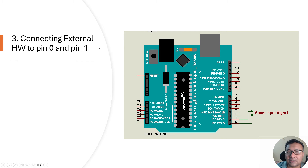The third issue is a design mistake: accidentally connecting signals to pin 0 or pin 1. If you connect anything to those pins, you will not be able to download programs, because pin 0 and pin 1 are the RX and TX pins used to accept data from the PC. If you need to use all 20 pins, try to make those connections removable with a jumper, or simply remove the pin 0 and 1 interfaces before downloading the code and put them back afterwards.